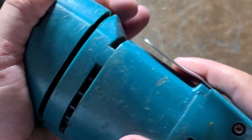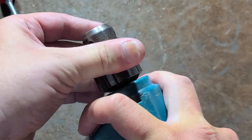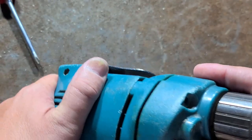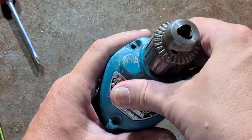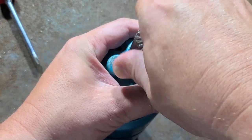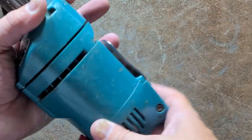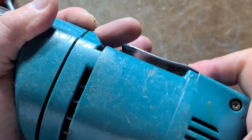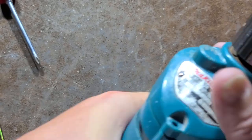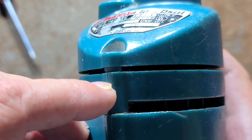Really tight. Sometimes you've got to turn it a little bit, just to help work the grease out of those bores. I'm fighting against a little too much grease in one of the bores — the easiest way is to actually turn the gears, so the extra grease can get past a little bit easier. That little boss also explains why the casing was cracked — it was probably a high torque situation, and the little boss put a little bit too much stress there.